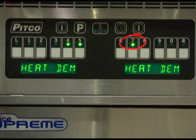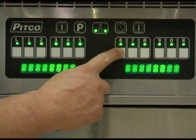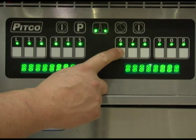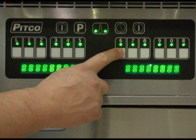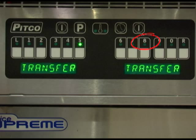The indicator light above key number 7 is the 24-volt heat feedback indicator, showing the on or off state of this input. Pressing key number 6 will perform a lamp test; all display indicators will be forced on to reveal any non-functional indicators or displays. Key number 8 toggles between using the right or left vat on a dual vat fryer for the diagnostics test.